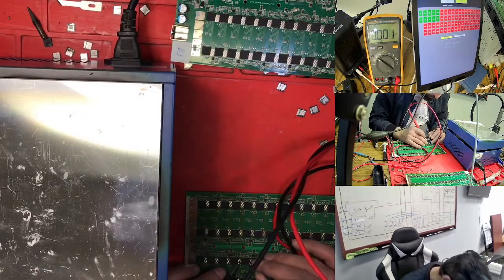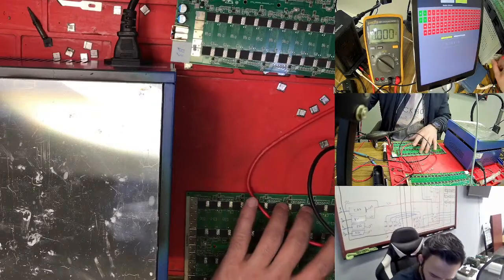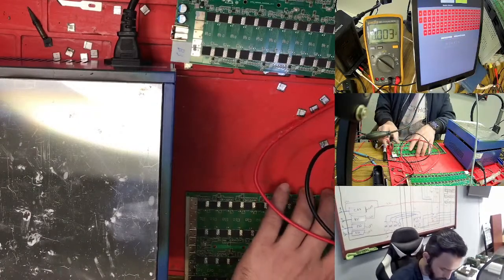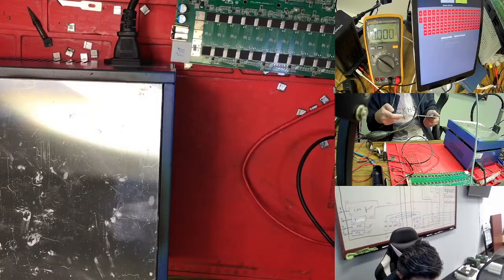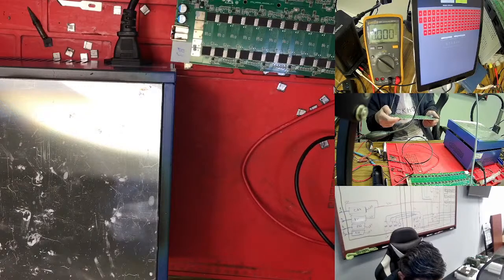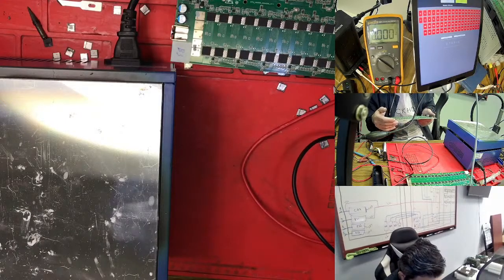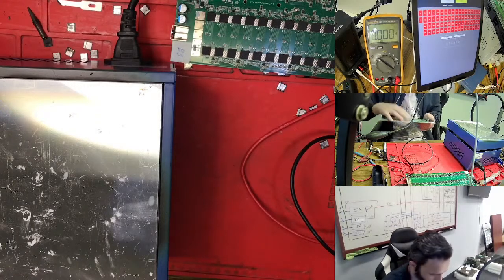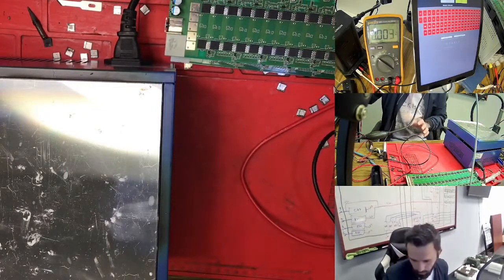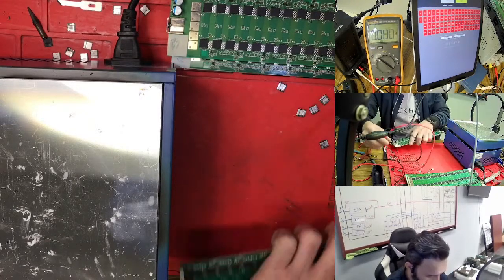So we just need to bring another hashboard to test, and then we take out another chip from it. But right now I know the chip is not good because I already changed the chip here, and it's not passing, it's stopping here. So what I'm doing is bringing another hashboard. If some numbers here are green, we take out one green chip and put it in the hashboard to test. If it passes, then my chip is not good. If it does not pass, then my chip is good. We just need to confirm this, because right now what I know is the chip is not good. Supposedly I made a mistake on one hashboard, two hashboards, three hashboards, but it's not supposed to be for all of them.